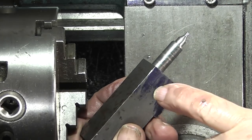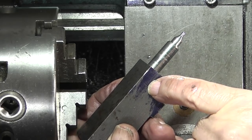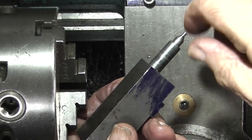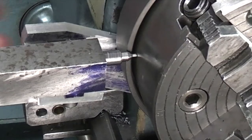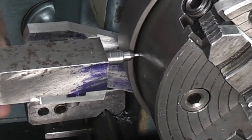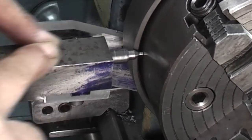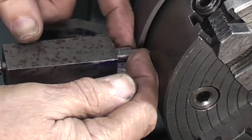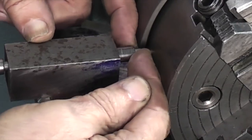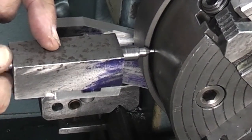All I need to do on the block is drill a hole through the side that's level with the bore, mill a little channel in this so that we can lock it in. Now this is what we've got so far. The block we've machined just wants cleaning up and tidying up. The plunger we made today, and it just needs a handle making on the end.